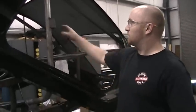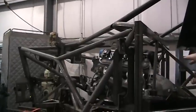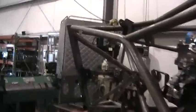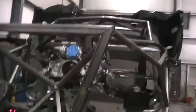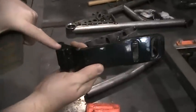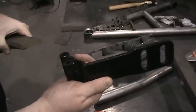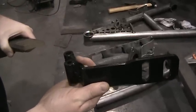So now what we can do is we have full adjustment in the back here to be able to do that without grinding. And again, up in the front we have full adjustment of the door and a much more rigid design to hold the hinges. One other thing to note is a change that we made to the actual arm. So this is the old arm with the pivot point, and then this is where the stops were for the detent, so the door has a couple of locations where it would stop.